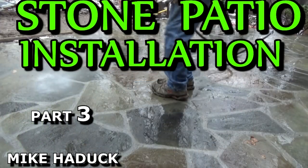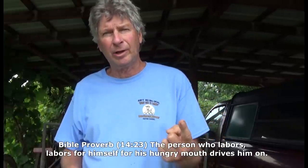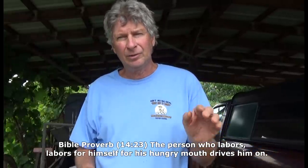So that's it. I have videos out on how to do a stone patio and how to do a sidewalk. You can get some clues off of that. You see me put the newspaper around. That's a little trick. I use 2 sand to 1 Portland. No mortar. Mortar shrinks, it'll fall apart in my area. 2 sand to 1 Portland.